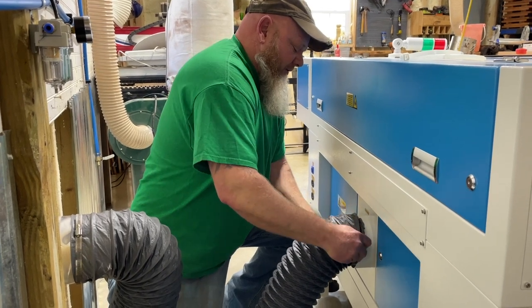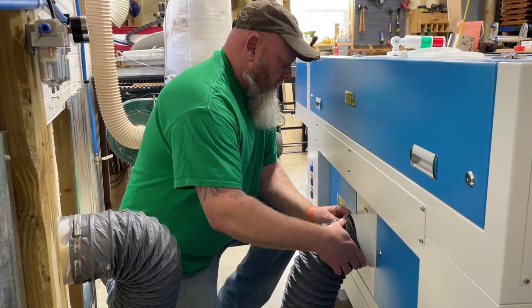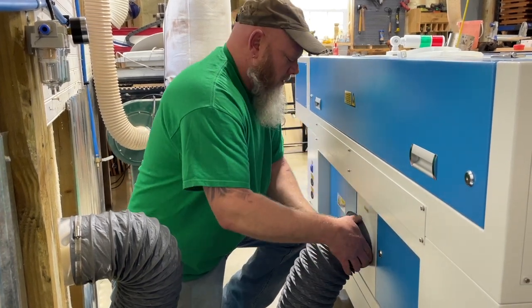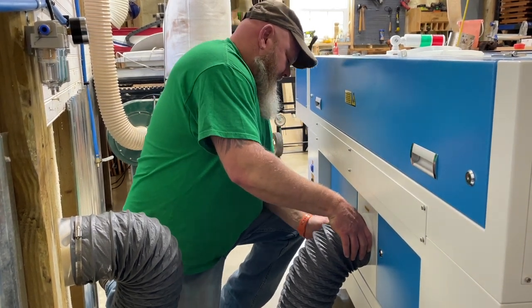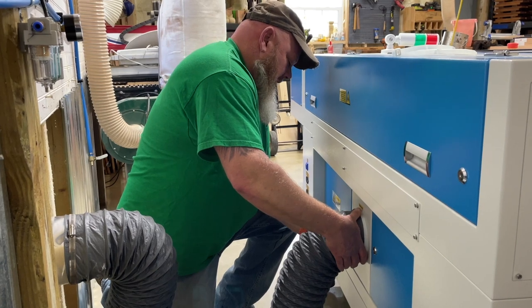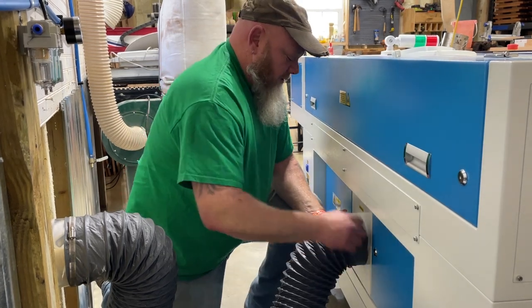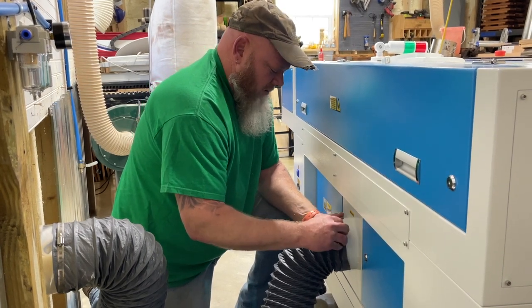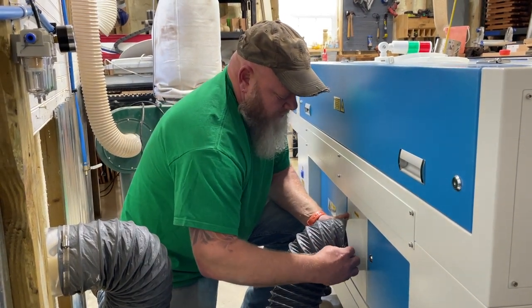At least this is better than ours. Sometimes you got to stretch the hose a little bit, and sometimes you just say screw it and throw away what comes with it, and go get the foiled or aluminum dryer vent in six inch.